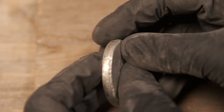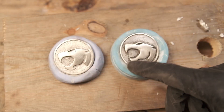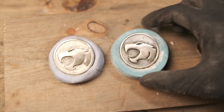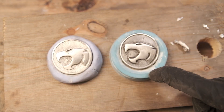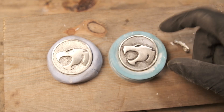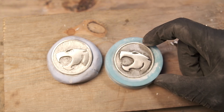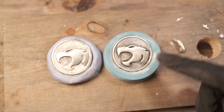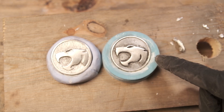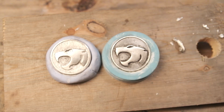You could make a two-part mold out of one of these and have a backside that comes in with something on it, but for today I just wanted to do that right there. In summary, it looks like you could make a pewter coin using silicone and mold putty — which is also silicone but the portable kind. If you're going for sharper details, try to use your pourable silicone. If you want a really heat-intensive mold material, look at Mold Max 60. Mold Star 16 Fast cures in 30 minutes — that's why I used it today. Both cure in 30 minutes.